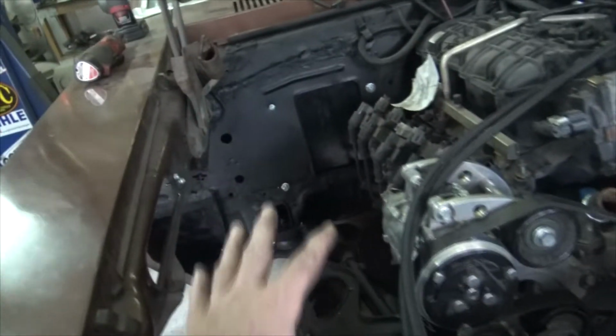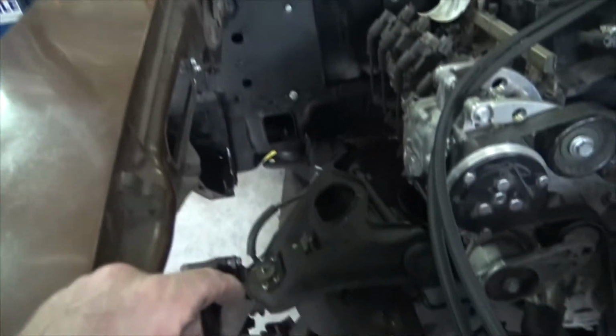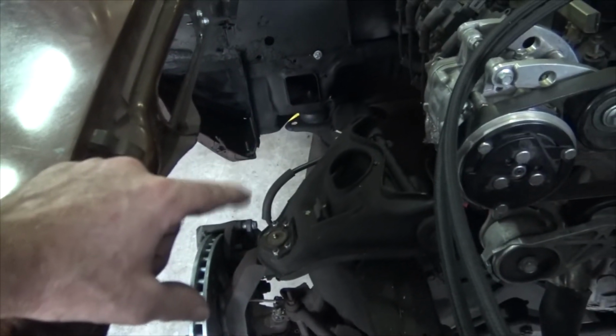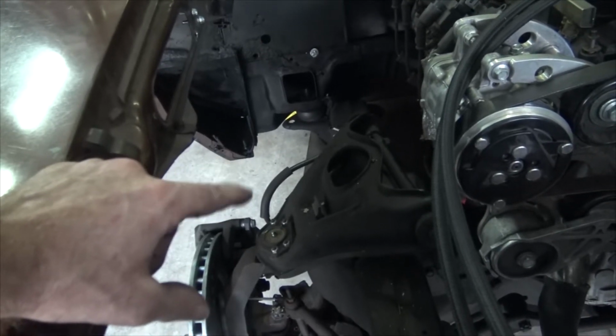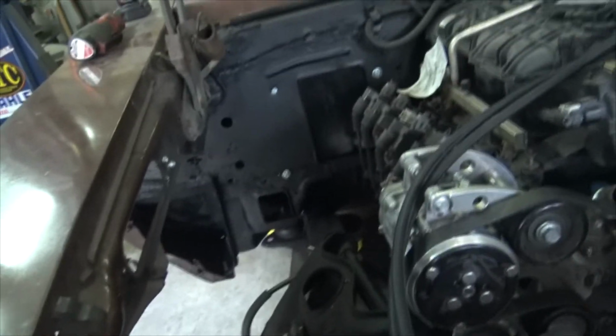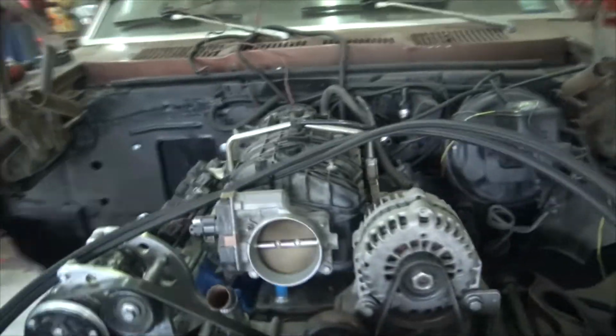So we know that we generally want it somewhere in this area, but we got to take into account all kinds of things like this fender well, this no, not over here. So we got to put that guy in. We have to figure out how much movement the suspension has in it. And the answer is quite a lot. We're going to have to reroute transmission cooler lines. And I want to build this guy and keep it fully away from our spark plugs and our spark plug wires so that we'll have easy, nice maintenance. Because I'm okay if it fights me tooth and nail the entire time to put it together, if it can be maintained easier.